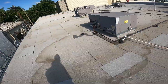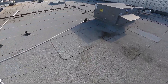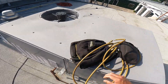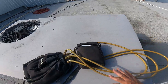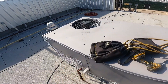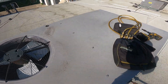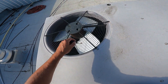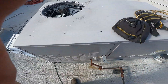We got problems. Problem number one: the tenant's not here, so I have no idea which unit I'm looking at. I'm going to attempt to start here and I don't know how big the suite is - I can't see the inside. I don't know if it stops here. I got a compressor with no fan - lots of heat, high head pressure. You want to bet this is the guy?